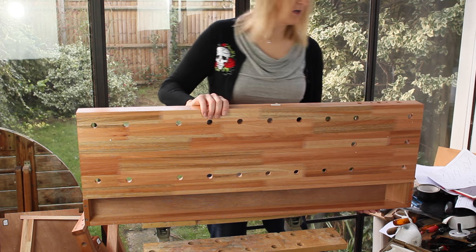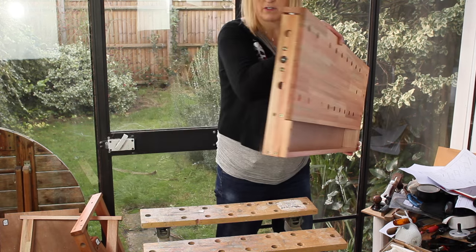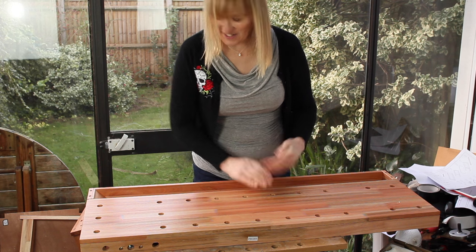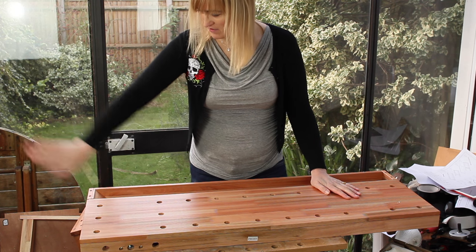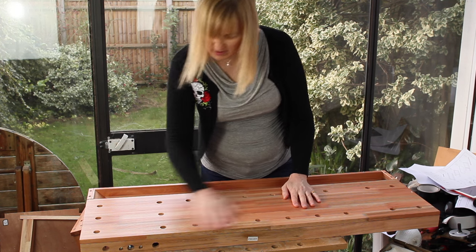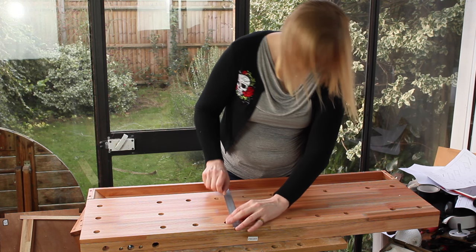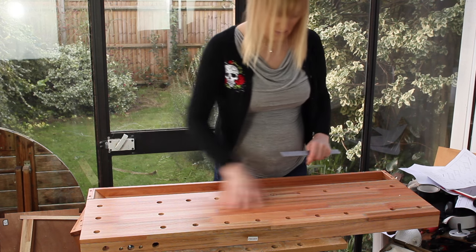We have a bench, we have a well. A nice feature is at this end there's a little ramp, so you can get your tools out easily. First impression: quite good. Very smooth finish. But there are some undulations in the top — it's not actually flat. The top's got a ridge down the middle, which isn't ideal. It's about a millimetre out — is that because the wood's moved or the way it's been braced?